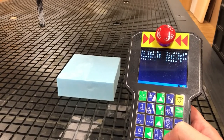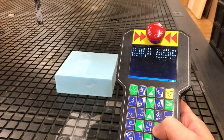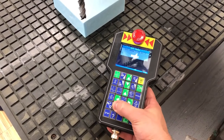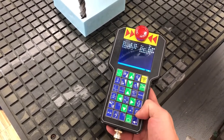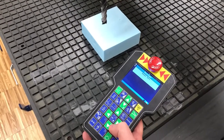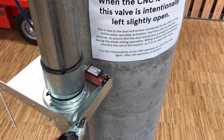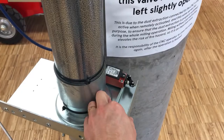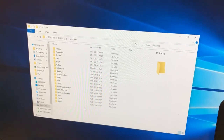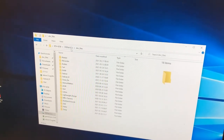Jog to the designated home of the toolpath that you have set up and set the soft home or work origin. Go to your designated home and you are all set. Open the dust extraction valve by the cleaning station only slightly so that the limit switch there is released. With your post-processed toolpath file correctly placed in your folder in the DNC files sub-directory on the C drive, you are ready to start.